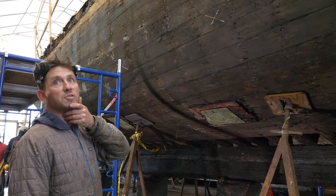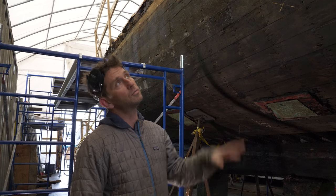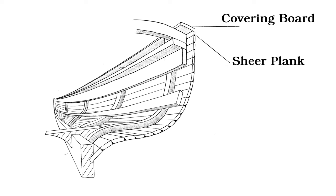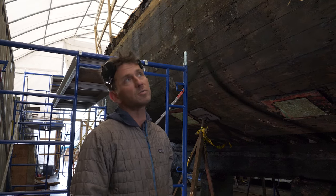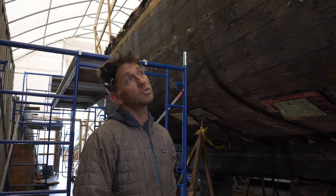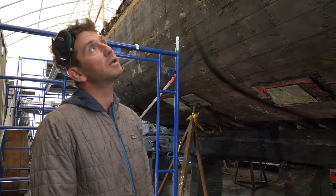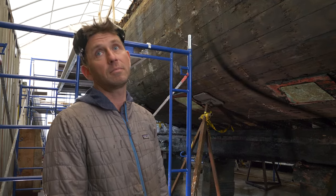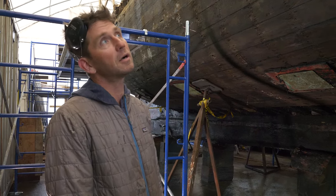It's going to depend on how many frames need replacing. The port side of the boat seems to be in a little bit better shape, but we also want to get access to the tops of our frame heads, so it means we'll be removing the upper shear plank where the break in the deck is, as well as the covering board. The current plan is to remove a section of all the planking in the bow on the starboard side and reframe that small section — probably three or four frames — then do the same thing on the port side. Simultaneously we will be doing the same thing at the aft end of the boat. Once we've got our covering boards off we'll be able to see what all our deck beam ends look like. From what we can tell all the ends are pretty short and it's probably more work to replace the end of a deck beam than it is to just replace the whole thing. For now it's bite-sized pieces that we remove until we are convinced about a plan of action.